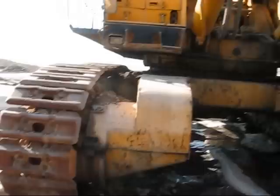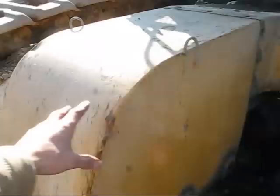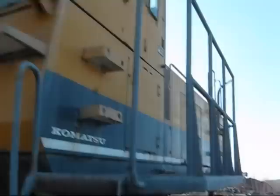You can see your two cylinders to push your stick in and out and your two boom cylinders. Looking at the front of the shovel, your two travel motors on each side of the crawlers. You can see the guards over the motors right here. Inside these are your hoses that run underneath your frame and up into your hydraulic system. These guards basically cover the hoses so rocks or anything don't fall and break the hoses on the machine.